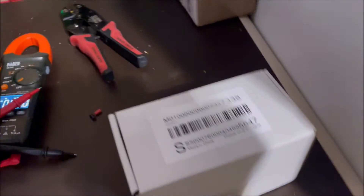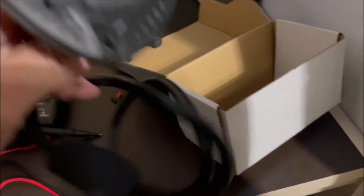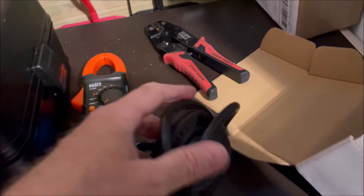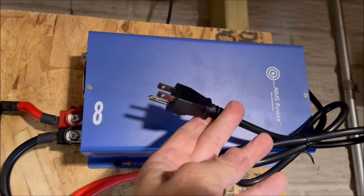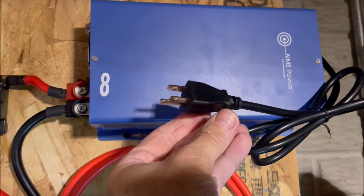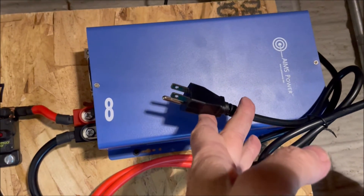Here's for future videos. We're going to install this pretty much right next to where we were out there — it's going to take a little bit bigger hole. This is where our generator outside will plug in. It'll come into two connectors on the inside, and one of them will connect up to our AIM 75-amp, 12-volt/24-volt battery charger. So if we're off the grid for a while because power's out and we need to charge the battery because we haven't had sufficient sun, we can hook up a small generator out in the back, plug it right into the back of the house, and charge the batteries.